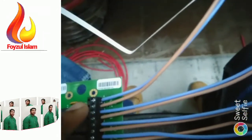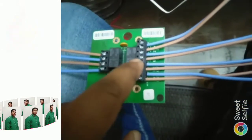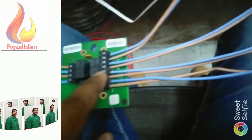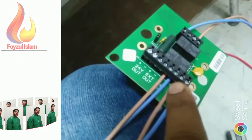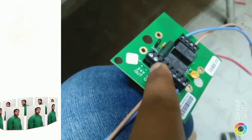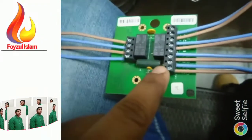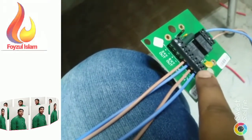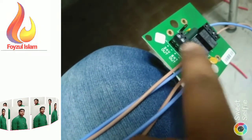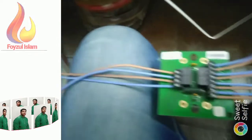Another exit cable coming from the panel connects here to the first sequential activator's exit-in option, plus and minus. From the exit-out option, take a cable to another sequential activator's exit-in option. Also connect 24 voltage out to the next sequential activator's 24 voltage in. Connect to exit-in, not exit-out — remember that.